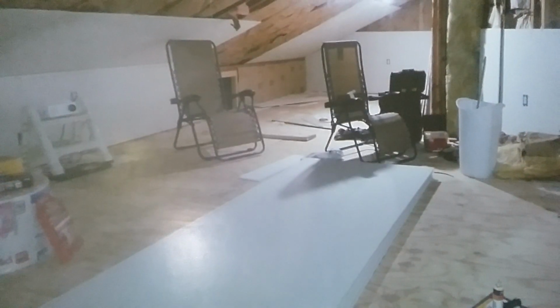And here we are with more work getting done. Every day, at the end of the day of work, I wanted to clean it up and make it look as good as possible, just keeping up with cleaning and salvaging as many materials as you can for the next day. Putting in the sheetrock, the drywall, was actually pretty easy. But you find that some of the wood is a little bit shifted, so it's not perfectly straight, and you're going to have to make allowances for that.